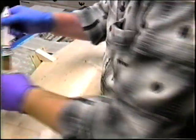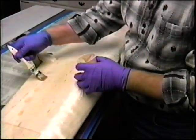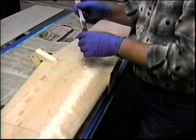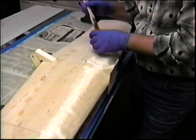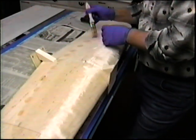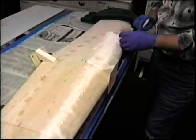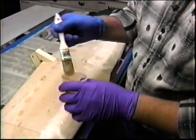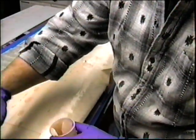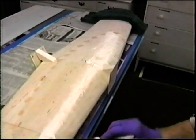One way, and we're going to try to use this method, is to get very little of the resin and paint down the corners. Herringbone them, kind of. And this makes the cloth get set in its initial position without a problem. When it starts to cure, it gets very, very sticky, so it's not going to go into the wood when you do it this way.